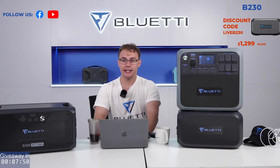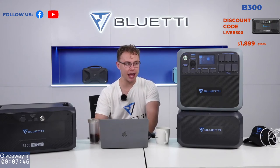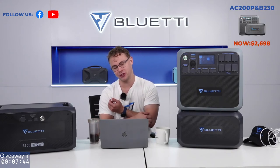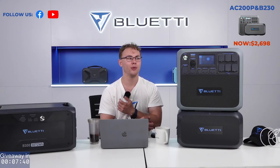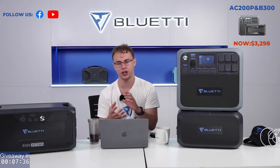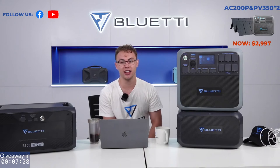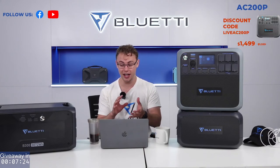Okay, number four, AC adapter and solar at the same time. How does this work? Well, you connect the solar panels, okay? So you do solar charging, and you also do AC charging or wall charging at the same time. Yes, you can do that, no problem. And the wattage is normally 1,100 up to 1,200 watts combined.